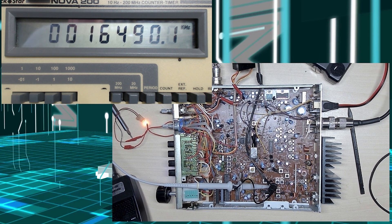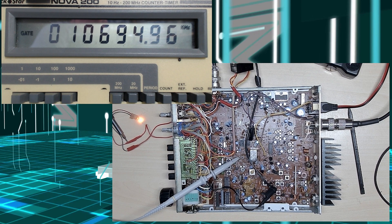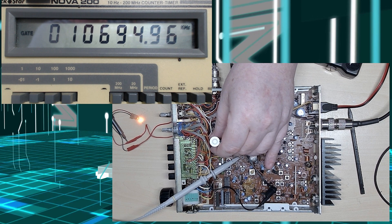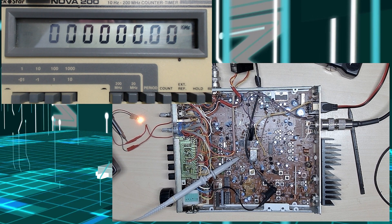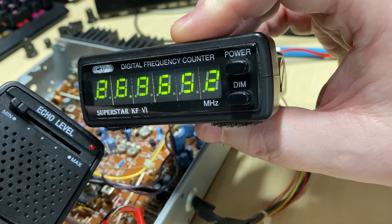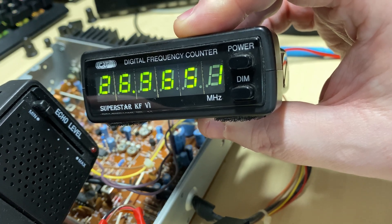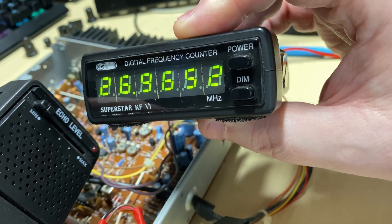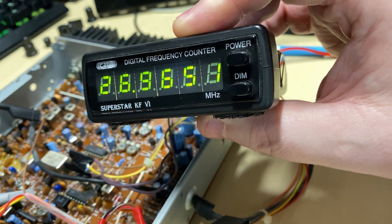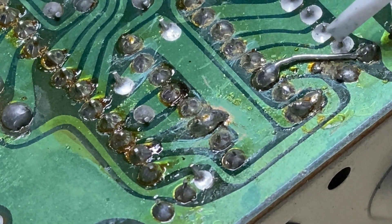This got me wondering — why is it so far out? Let's have a look at 10692 and 10695. That's TP4 and TP5; for 10695 we need AM transmit. It's showing RX but as soon as we hit TX it's jumping up again, so alignment hasn't stopped our problem. But this is bizarre — little did I know that I had just aligned it 5 kHz above, but never mind.